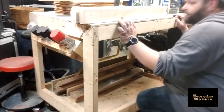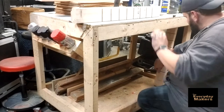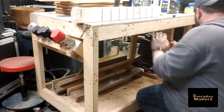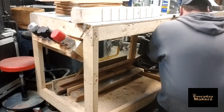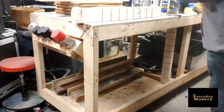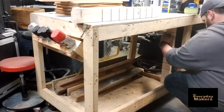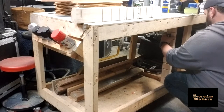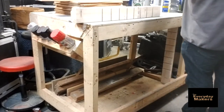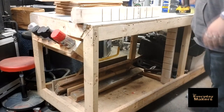Welcome to under my workbench. Here's the plan - one of these boards kind of wedged under here, screwed in, slide some shelves in. Middle board, outside board. Let's go ahead and put that together. I'm doing my best just to give it a little quick level, just make sure I'm shooting the right spot. As long as we're plumb - got it. It's not going anywhere. I'm going to shoot a second one in just to keep it from spinning. That's one - five more to go.